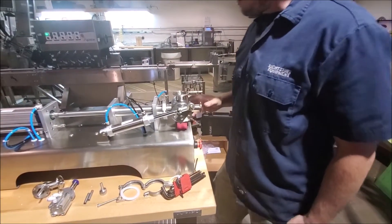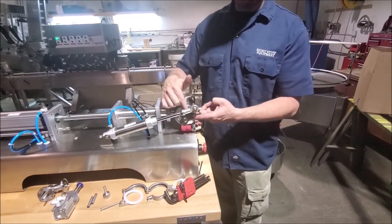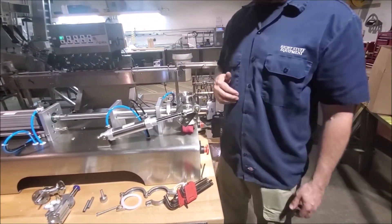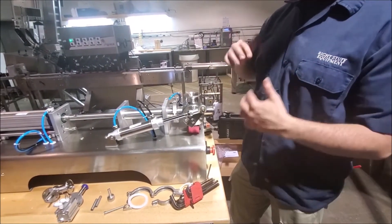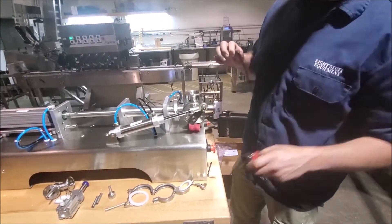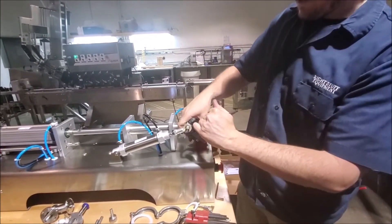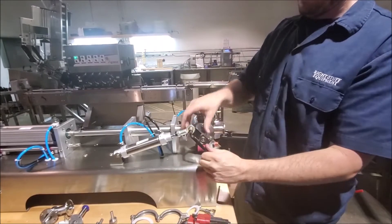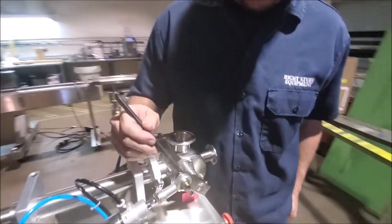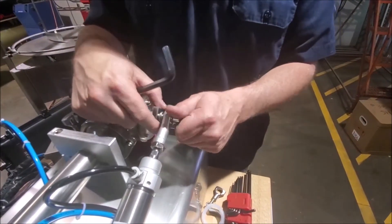Next piece — this is our three-way valve. An important note here is to make sure when we take this apart, do not remove this arm here. If this arm gets out of whack, it won't properly turn that three-way valve, and our fills can be inconsistent because that valve isn't opened up properly. So to take this apart, we'll take this piece off with an eight millimeter Allen wrench. If we look here, in between our air cylinder and the arm is a lock washer — we want to make sure to get that back in the proper spot when we put it back together.